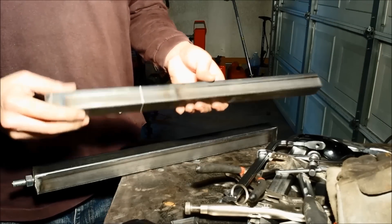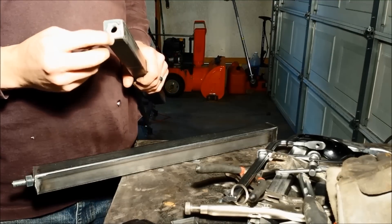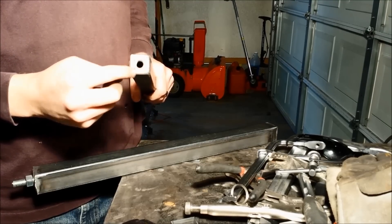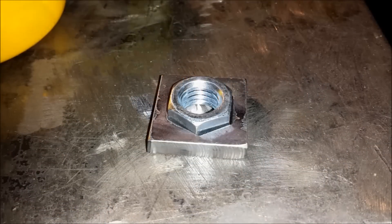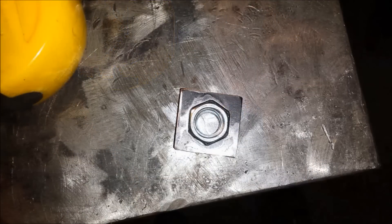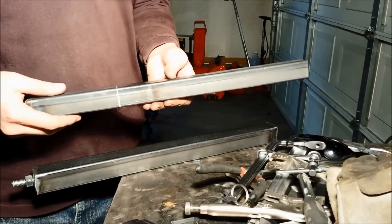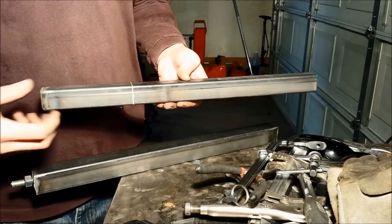The inner tube — there's nothing special about it other than on the bottom I have a nut welded onto the end. I have my CNC machine, so I was able to cut out the correct shape for the nut seated in there, weld it from the other side, and then weld it on the outside as well. The tube is about 20 inches long, but I'll make a final video with all the measurements when I'm done. It's 13 inches to that point, then about four or five inches the rest of the way.